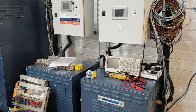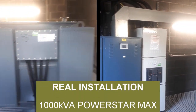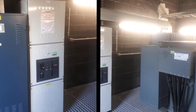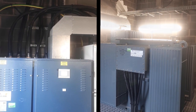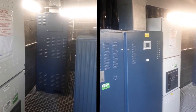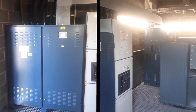This is a real 1000 kVA low voltage PowerStar Max installation. The site's 11 kV HV transformer is cabled to an incomer, and the incomer is cabled into the PowerStar transformer which is then cabled into the LV switch room. Due to the size and space available on this installation, the PowerStar Max electronics are installed away from the PowerStar transformer and connected overhead. Typically the PowerStar transformer and the Max electronics will be installed side by side or within a single unit where possible.